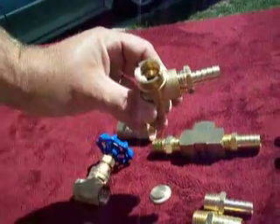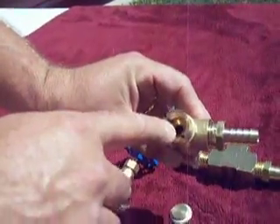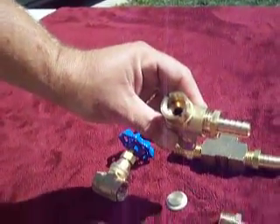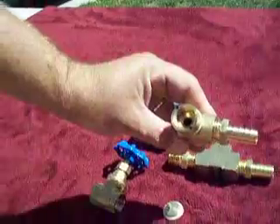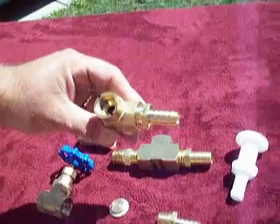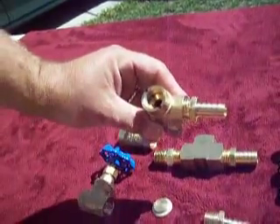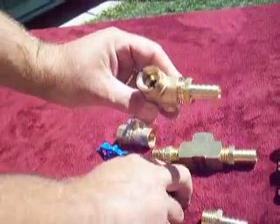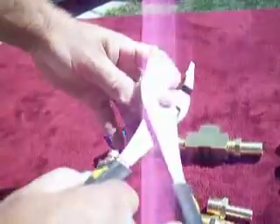I've already got marks here to give you a reference of what the factory settings are, and there's a little nut in there. If you have too much water pressure in your engine and you want to relieve the pressure sooner, you would loosen the screw a quarter turn at a time. Go out and drive your boat, see what your pressures are, and then loosen or tighten as needed. When you're done adjusting, just put the cap back on, use pliers, and tighten it. It's real simple.